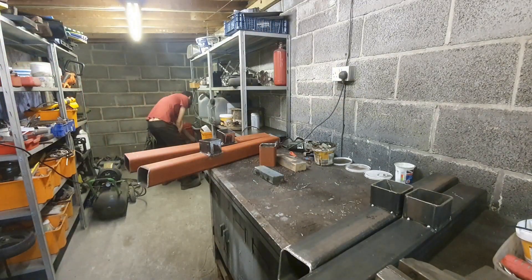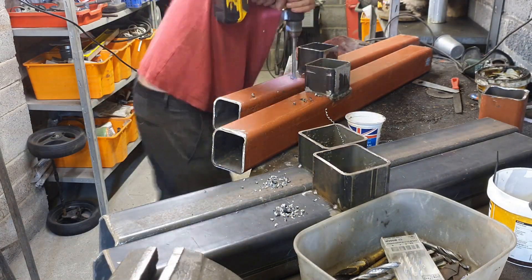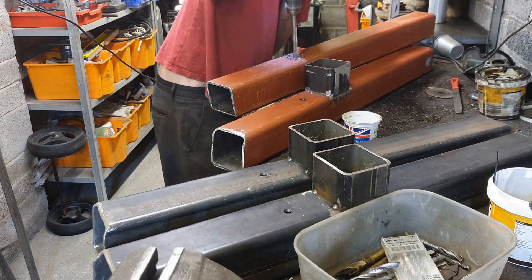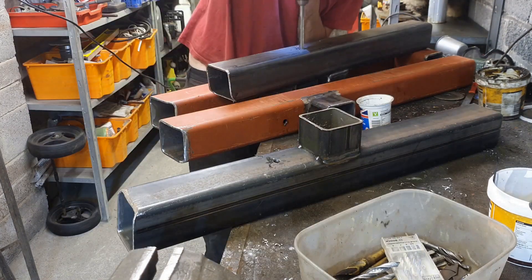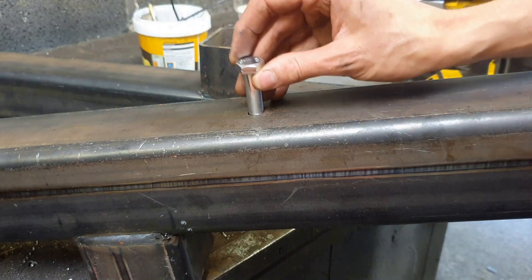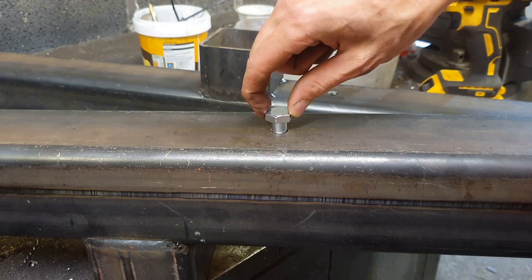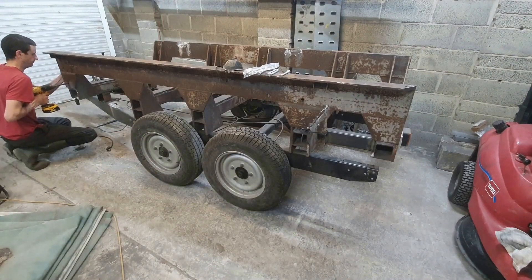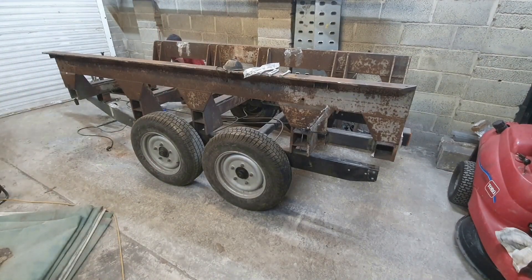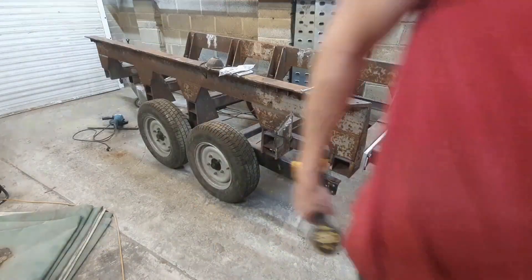Now I get the 100 out just to take those 9s out to 12mm, and then those are all the right size to take the bolt — which you can see in just a moment. I don't know why I didn't use the pillar drill for the 12mm, but anyway — that's the bolt, a nice fit. I'm going to drop it in, and actually when this is complete I'm going to use a little jubilee clip to hold that bolt inside so it's permanently with the leg to speed up assembly. Jack it up, put the legs on, take the wheels off, lower it down. I'm going to have to do this at every show or mapping event.